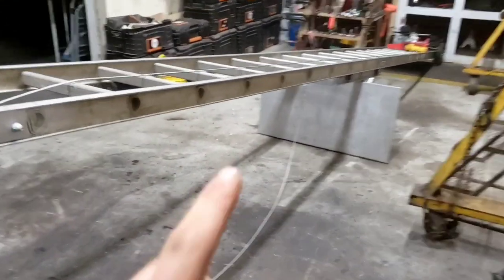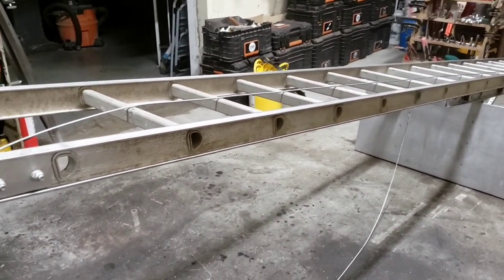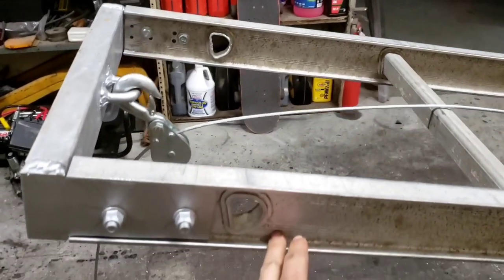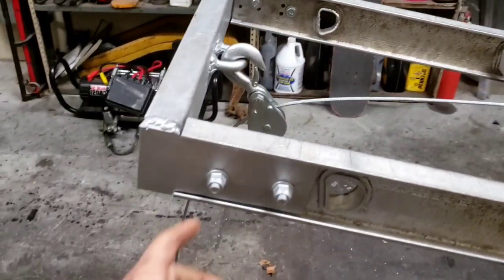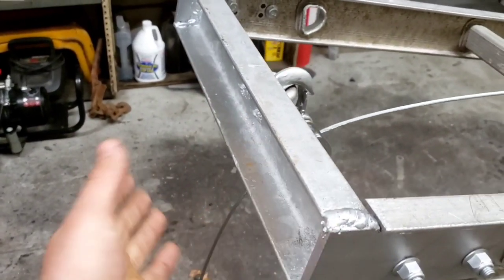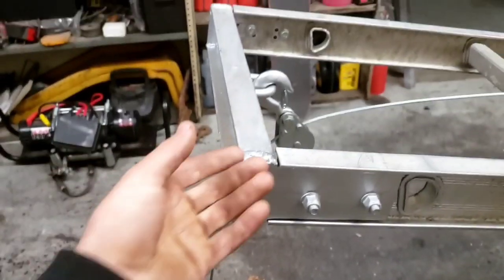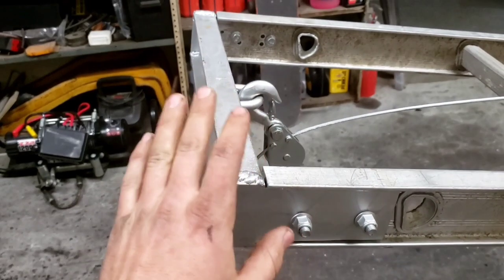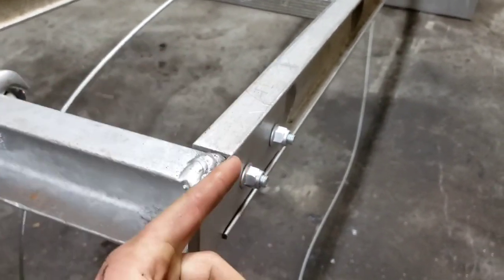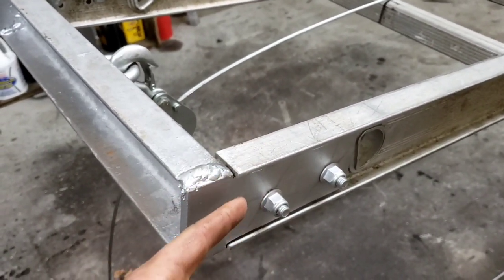The ladder is completely built out. I want to go over the connections in detail to give you some insight on how to do it yourself. Starting at the top, because that's what I fabricated first — we're essentially working with an I-beam. The ladder is made of aluminum but that's essentially what it is on both sides. Inside this channel I used 3/8 bar stock, and on top some 3-inch C-channel. You could use pretty much any type of tubing or another size C-channel up here. The basic idea is it slots in and you're utilizing all that surface area and the vertical I-beam in compression, getting the full strength out of the structure rather than putting too much stress on just one edge or face.